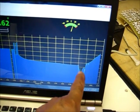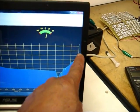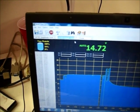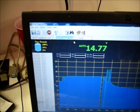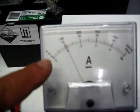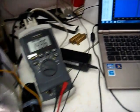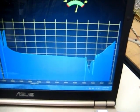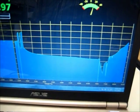The curve is linear, almost straight up, and then it's going to reach some level and round off. We're at 14.72 and continuing to climb really quick here. The panel is putting out 1.1 amperes. As that climbs up, this current is going to come down. You can see that the alum battery charges on a completely different curve than lead acid batteries or even the NiCad battery — it's like a cross between them.